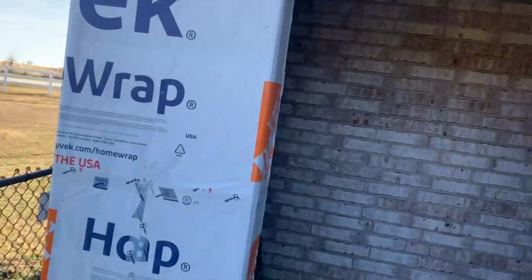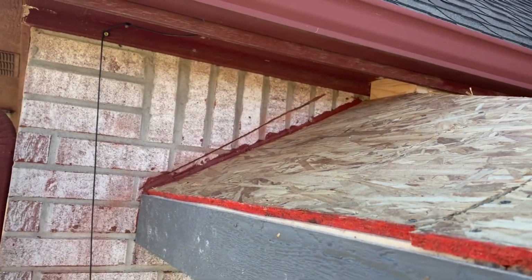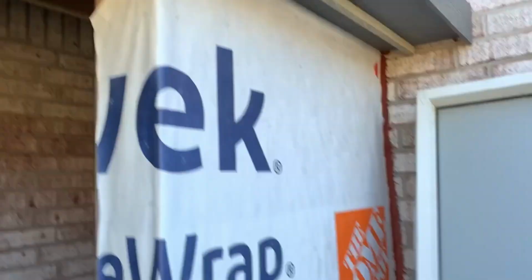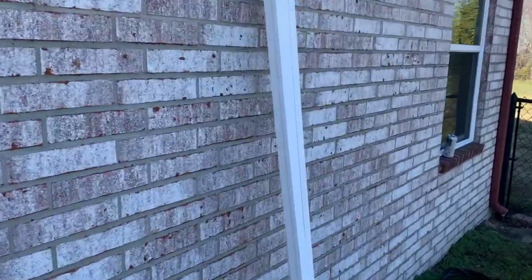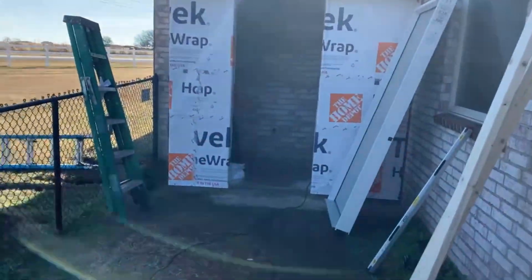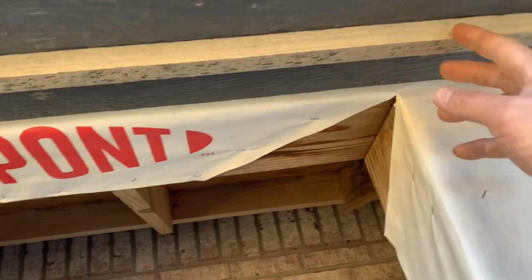We got to re-grind this section up here so I can put my roof flashings on. And we just got done putting on these strips right here. But then I realized, after looking at it, since I'm not putting any brick up here, I don't need it in this area. So once we get the door on and we get the brick mold, in California it's called stucco mold, out here and all this stuff right here, then I'll figure out where I need to have my stucco stops return at.